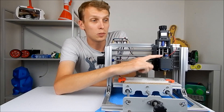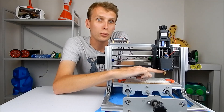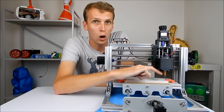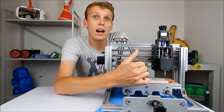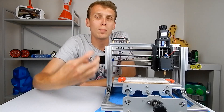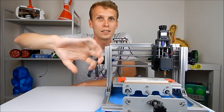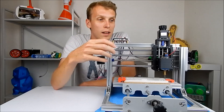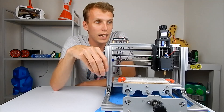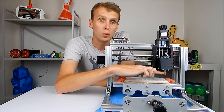The reason some machines have this brass piece is the underpowered motor. This motor has a 3.2mm output shaft, which is where the brass connector comes in — it has a 3.2mm hole holding both the bit and motor shaft. The size up motor has a 5mm shaft, which means it can take an ER11 collet — a proper CNC collet with fingers that grab the bit as you tighten an adjustment ring around them, always holding the bit perfectly centered.